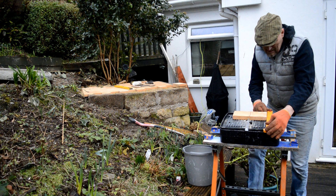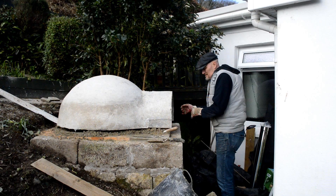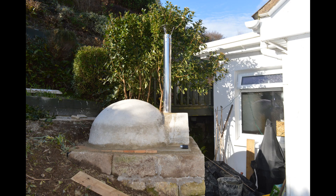Actually the tiles were the most expensive part of the project — I think it came in at £137 for those. And then when I cut those all to shape, I sat the pizza oven on a 30mm ring of fresh vermiculite, then dropped it down and left it for another fortnight just to really get bedded in.